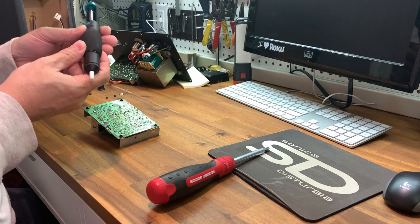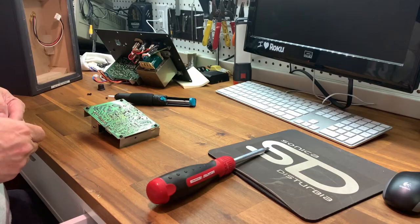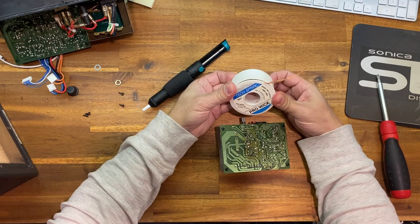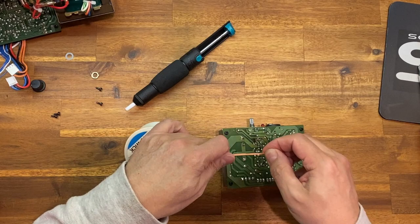You can use that. You can also use a product called solder braid. This is just literally braid of copper. It's great stuff. This one here is actually a really big roll that I've had around for a long time, and it's getting a little old, so it's a little grumpy sometimes. You've got to really heat it up. But with this, you would lay the braid down and then heat up the braid, and the solder gets wicked